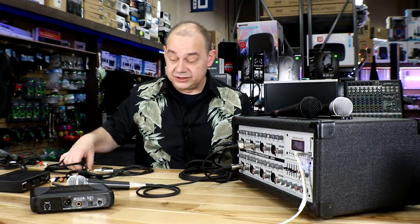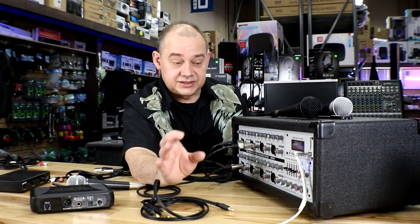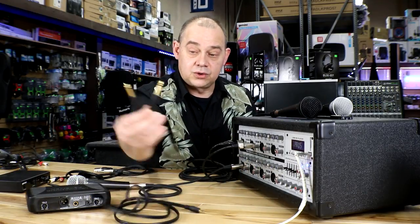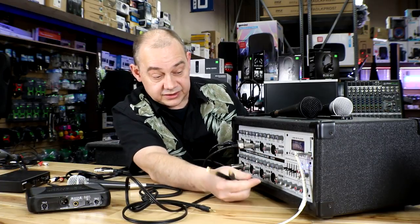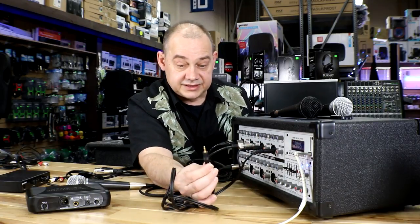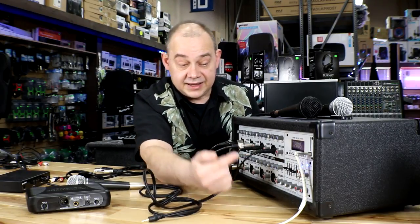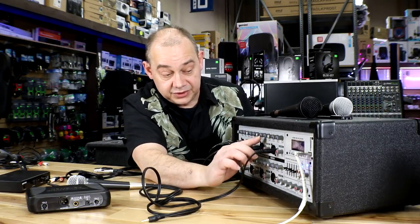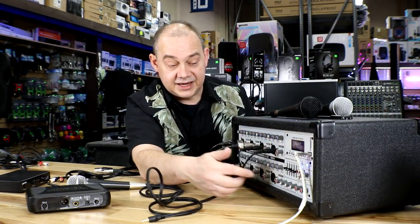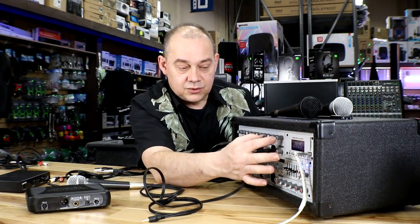Cables come in a lot of variations. If you want to plug in your laptop, phone, or anything, and you want bass and treble control alongside the five-band EQ that's built in, you can get a cable with quarter inch connectors and plug directly into the channel inputs. So with gains down, you plug one in here and one in here, and connect it to your phone, tablet, or laptop with a 3.5mm on the other end — and we're off to the races.